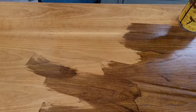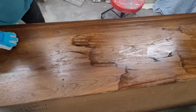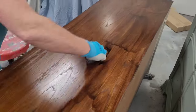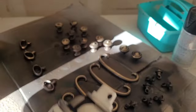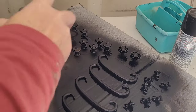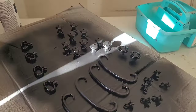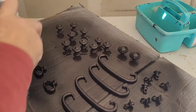The stain I chose is called Jacobean — it's a really nice dark color that gives good contrast with that neutral body color. I like the look of a dark top with a neutral body, and I'm also going to be doing some dark hardware. I wiped on the stain and came back with nice even long linear strokes with the grain of the wood. For the hardware, I cleaned the pieces by soaking them in white vinegar and water, then sprayed them with a black primer. After that I chose a bronze spray paint to go over the top — it gives a nice deep rich bronze color.